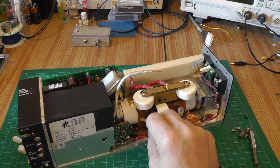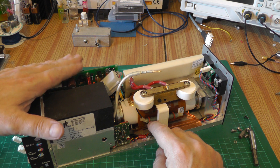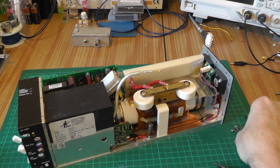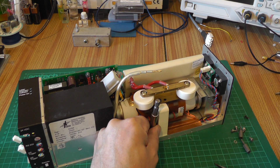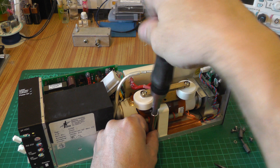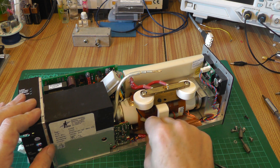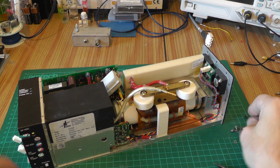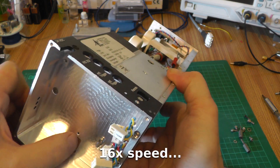If the microcontroller has failed, chances are the high voltage power supply is good, and chances are the pre-ionizer board is good. So maybe we can take a look at those. I'll just disconnect the ground lead from the power supply — that's us. We've got our high voltage positive there and then the ground from the high voltage PSU. There are plenty of bolts holding this on — a couple on the bottom and then some in the back of the case.